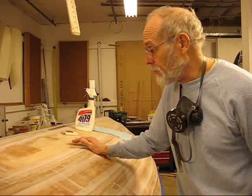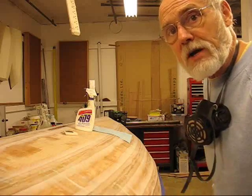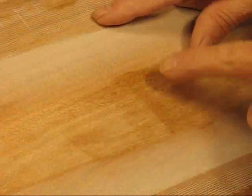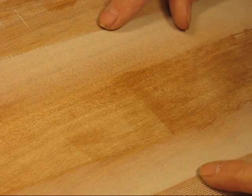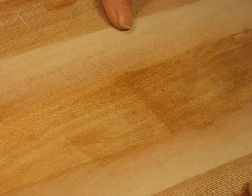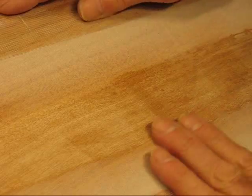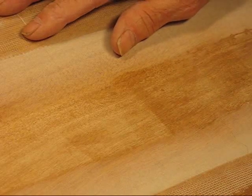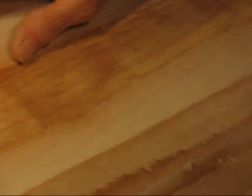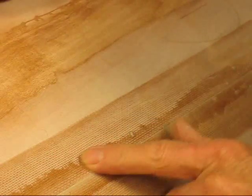There will probably be very little, if any, fairing at all once I get the six-ounce cloth in. But I've got to wipe it down and let it set for the night, and then tomorrow I'll do that again. Let me zoom in close to show how the sanding edges feather up. You can see how the fairing goes from dark white and then just kind of disappears into the wood again — I really don't feel any kind of edge in here at all.